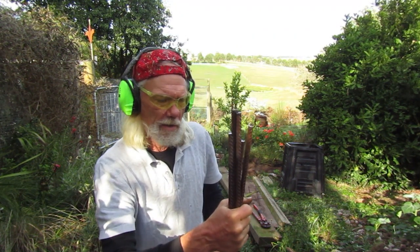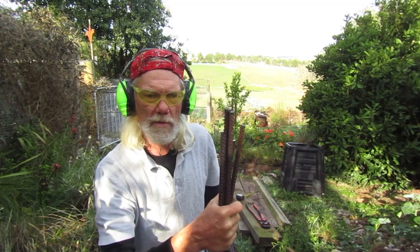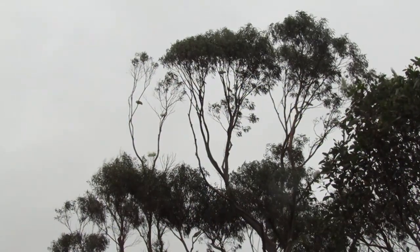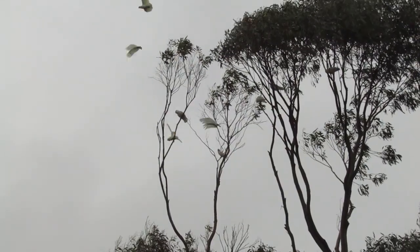These are going to go in vertically with the concrete, leave them sticking up so the blocks go over the top of them and it all ties the block wall into the concrete foundation. The local Corellas are always reminding me every morning: take a break, have a coffee, think about the next stage before we move on.